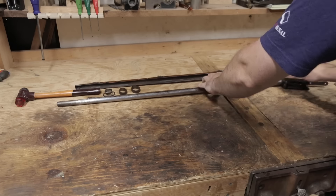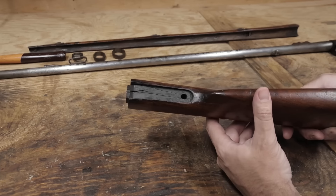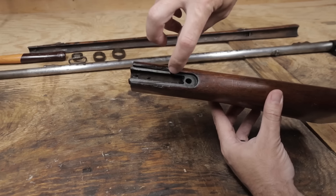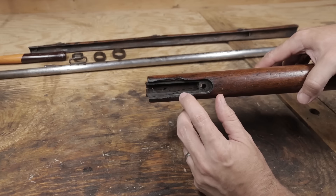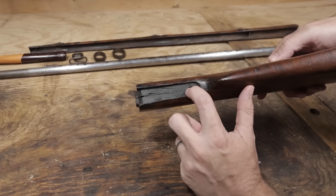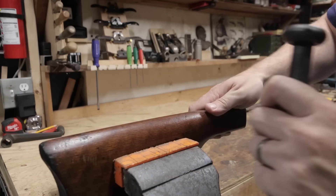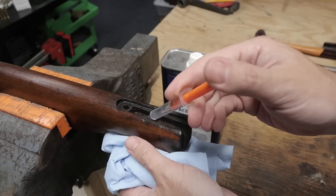Now that the metal parts have been fully inspected, and in the case of the rear sight fixed, I can turn my attention to fixing the stock. It looks like there are two main cracks — this one in the middle goes all the way down to the comb, and on the bottom it's about the same length. This crack off to the side goes down alongside the upper tang to the screw; I don't see it going past it, and the same on the bottom. Both of these will need to be fixed to prevent future damage. To do that, I'll put the stock in the vise and start by cleaning the oils and grime out of the stock with acetone — this will ensure the epoxy I'll use to stabilize the cracks can fully bond with the wood.